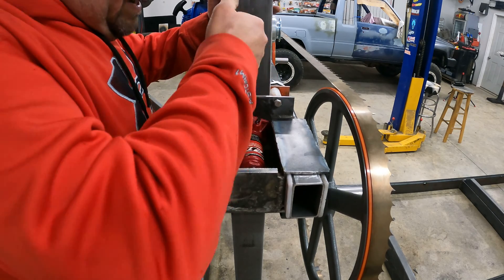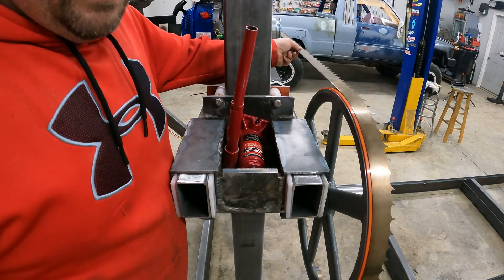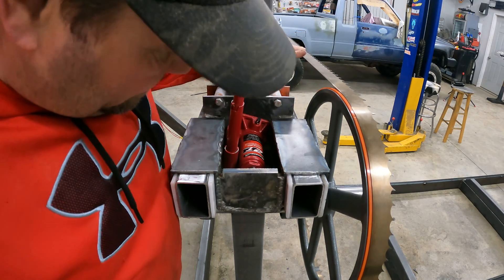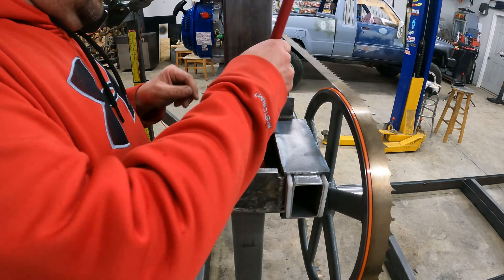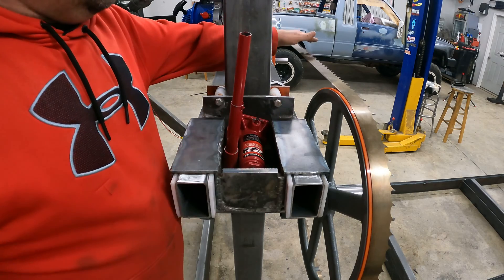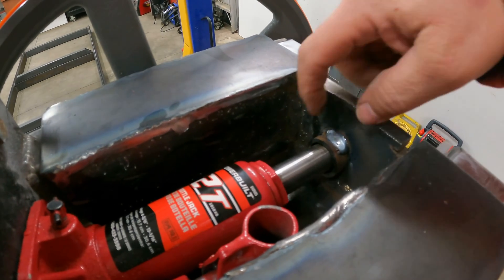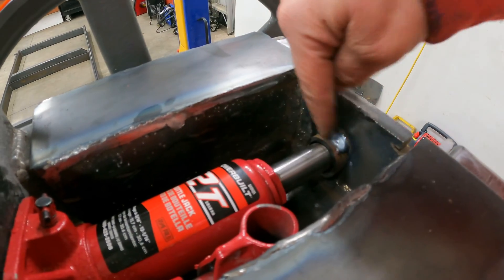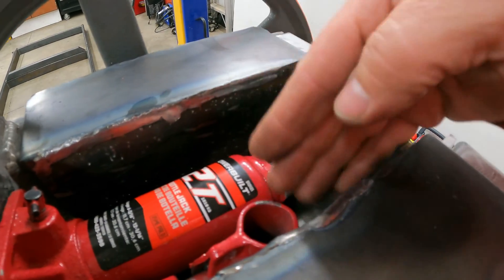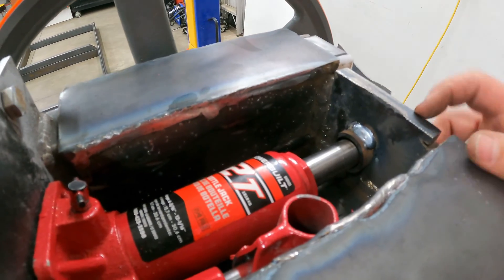It's very, very tight right now. I think this blade requires like 1800 PSI pressure to keep it where it should be, so it's going to require a lot. Then I can let the pressure off when I'm done — that way I'm not keeping that tension on the blade. Down here on the half-inch plate I put this piece of pipe right here, just welded it in there so the bottle jack has a place to ride where it doesn't try to kick out. At least it's going to stay inside there once I put the pressure on it.